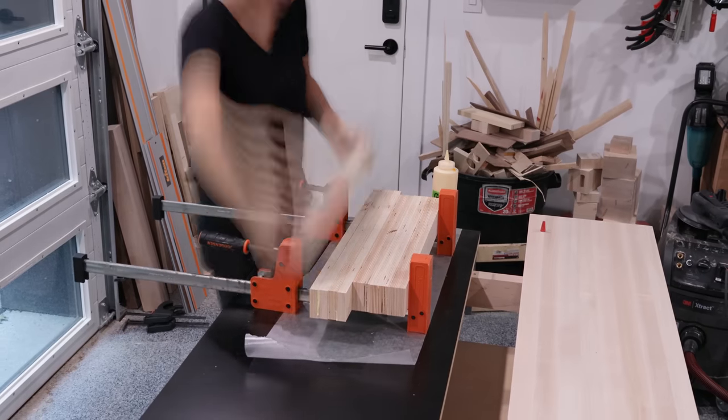First up we have the tail vise. A dog goes into the slot so it can travel along, and then there are more dogs with three-quarter inch shafts that go into the three-quarter inch holes that were drilled out. This is great for clamping up small objects. For larger objects, the holes run along the bench so you find the next hole, move the vise back, and you can use this all the way down the length of your bench to accommodate longer pieces. The piece is nicely secured down to your bench and you can use a hand plane, router, sand, chisels — whatever. Your piece is not going to move. And you're not limited to the length of your bench — you can actually use this to extend your bench.